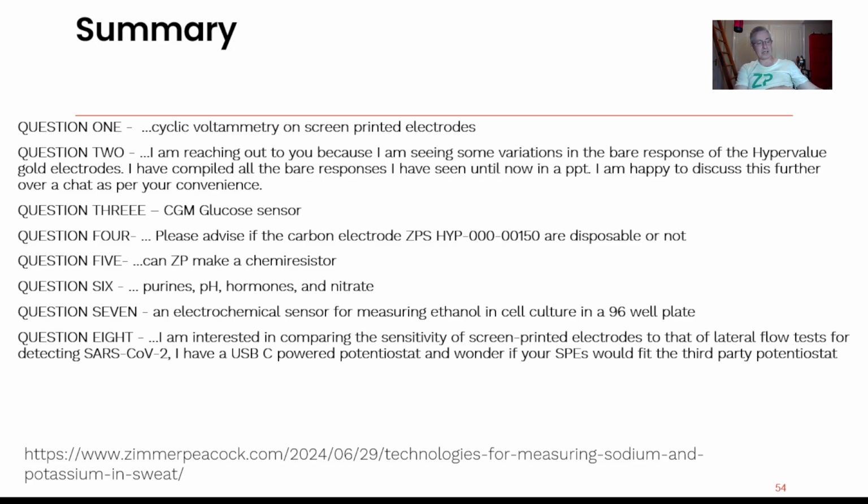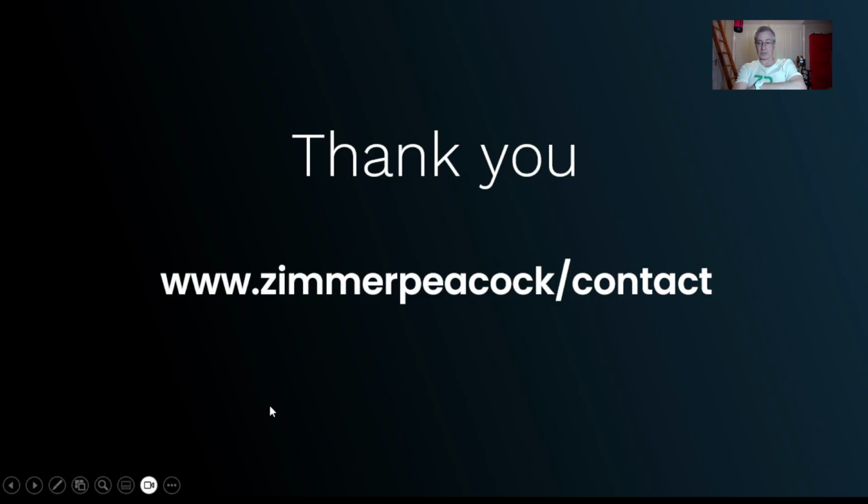The particular potentiostat you have may have a few problems, but I'm also biased. I prefer that you use our potentiostat. Our screen printed electrodes do have the right connector for the potentiostat that you're interested in. What I mean by that is these pads here are 2.54 millimeters apart, which will mean they work. But if you run into problems either through connection or just through science, it is going to be harder, if not impossible, for us to otherwise support you.